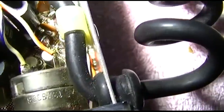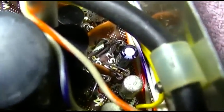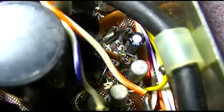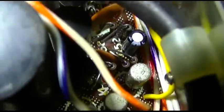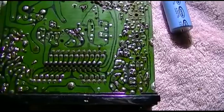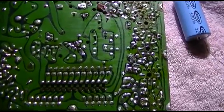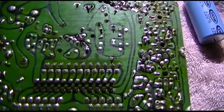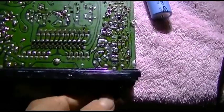You can see there's one capacitor there that I changed. You can see that transistor right there, and right there is the driver transistor next to that little transformer. The symptom with this radio is severe hiss — like severe white noise — and I'll give you an example of that.